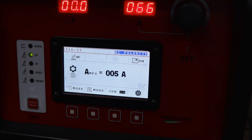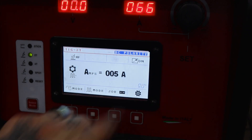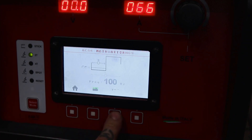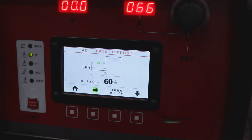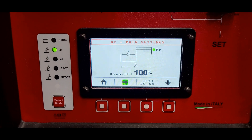What I have here is just two quarter-inch parts. Let's go over to the welder and set up the machine. Since we'll be welding aluminum, I need to switch over to AC. As you can see here in the top right we are still on DC polarity, so we'll come down here to the AC mode button and turn AC on. I'm at 100 frequency. For the balance setting — pretty typical with newer machines — I'm typically between 60 to 70 percent on normal material, unless it's something really dirty or if I'm welding cast.